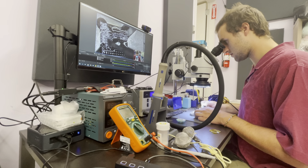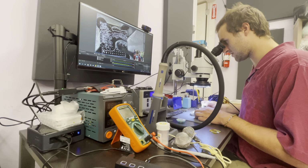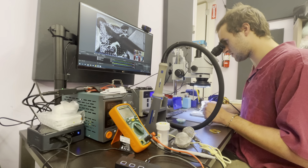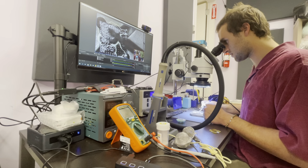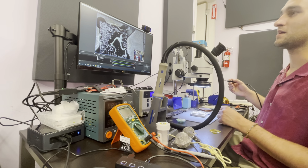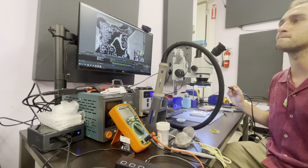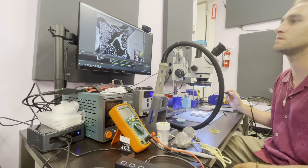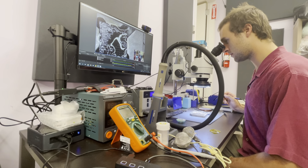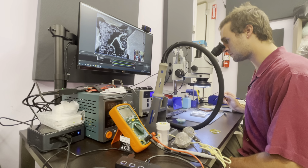You cringe when you see these. What are they? The new era. Yeah. The newer Intel era. Yeah. Oh, it looks like there's a pad that's not even there. That looks like it's been popcorned. That's done. Your SMC's done. It's done for. Yeah. Put too much heat on it. That's what I see with this bubble. Yeah. See the big bubble around there? Mm-hmm. Yeah. Oh. Popcorn. So how do you call popcorn?